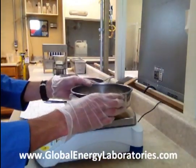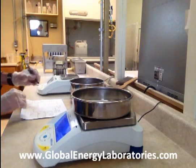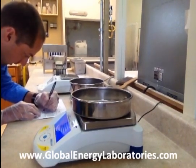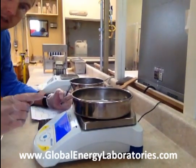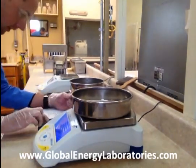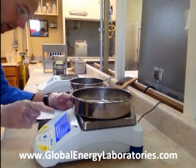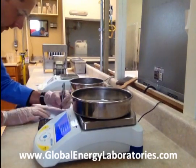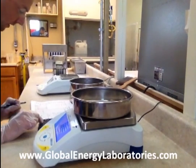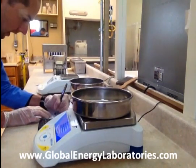It's the material that crushed down and ended up in the pan. So I'm going to record the mass. I pre-recorded the mass of the pan by itself clean, so I subtract the pan from the mass I'm reading on the scale. Now I divide that by the original mass, 36.774, and I get 8.2%.